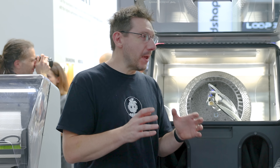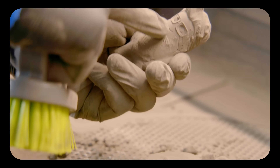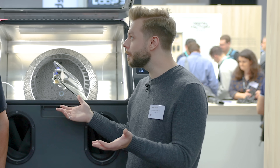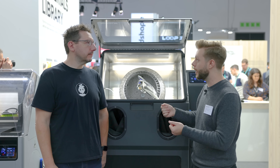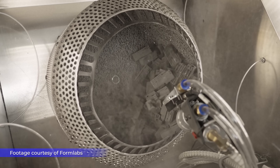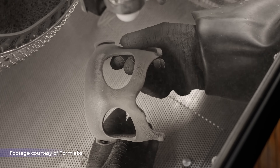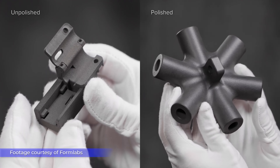10 minutes? I spent way longer than 10 minutes under the hood of the sift brushing and cleaning parts. You spend five minutes on the sift knocking off that powder — you get about 80% back just by breaking them out of the cake. Then all that powder that you'd typically have to blast off one by one, you just put them in the machine, hit the button, and it starts to tumble while blasting them with media. When they come out, they're totally clean to the touch and ready to hand off.